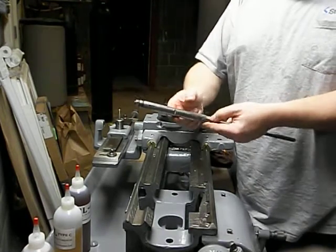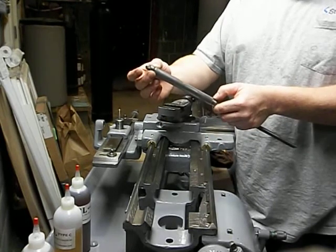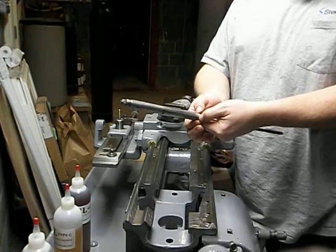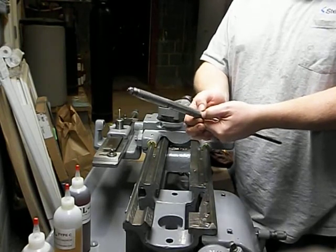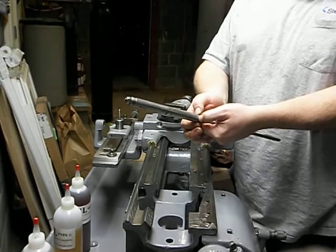The screw passes through it. There are a couple of thrust bearings in here. You can look up the specific assembly details, but basically you've got a cast shoulder here, a hardened washer, the brass thrust ball bearing, another hardened washer.